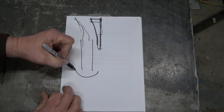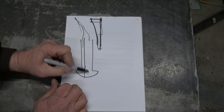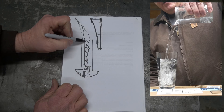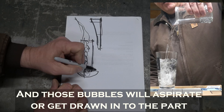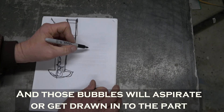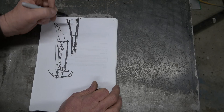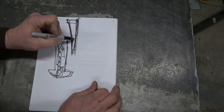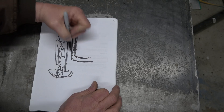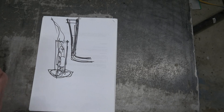What happened at the bottom of my basin — I had a big thing cut like this, right? That metal came down and you saw what happened with the glass: it bubbled and it bubbled, and this bubbling continued all the way up until the sprue was full. There's so much empty space in there. When we do a tapered sprue, we're mimicking that shape. As the metal flows through, there's no bubbling because it's full. If our running system has the same cross-sectional area, the metal should just flow right through without any of that turbulence.